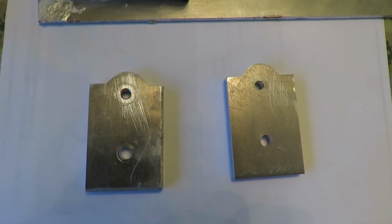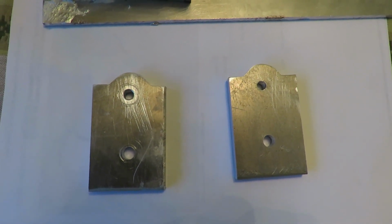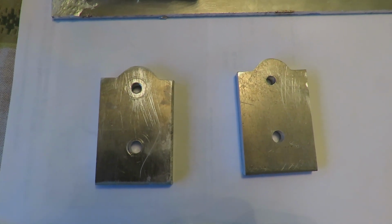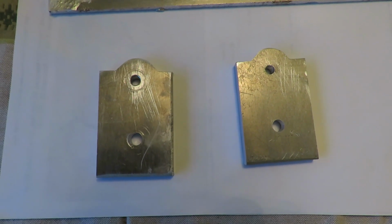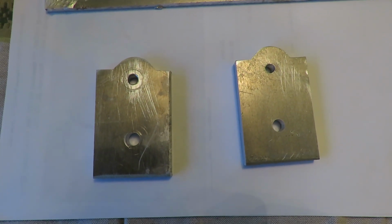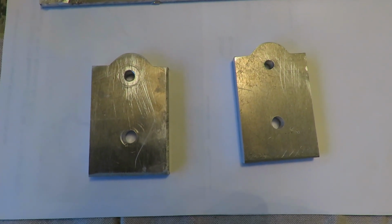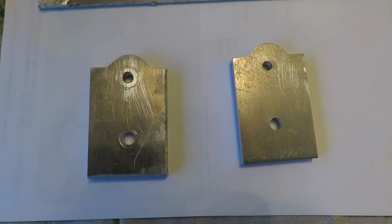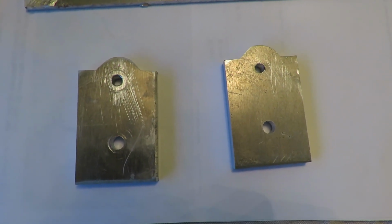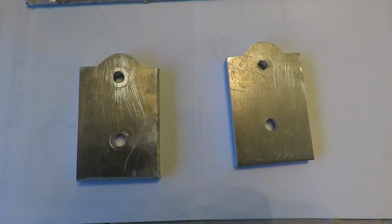Now there's another problem I've got. I've got an old machine, the tolerances are much looser, and therefore chatter happens if you don't do things right. Well, I didn't do things right. What I did was, I see the two holes there on each one, I bolted them together and then tried to have that as part of what fastened it. Well, I had too much sticking out of the vise and it caused chatter.